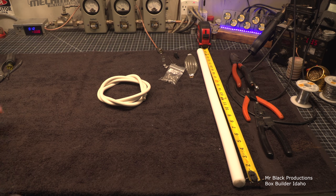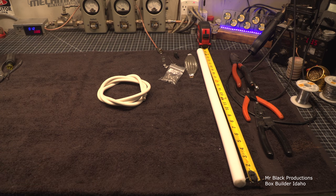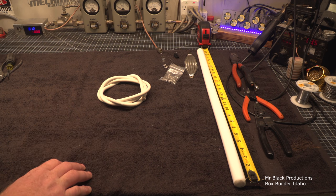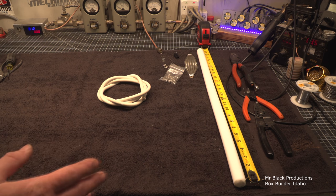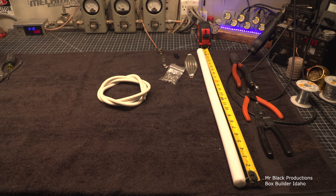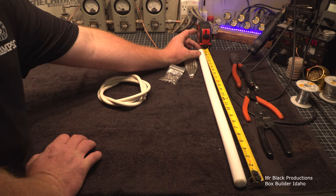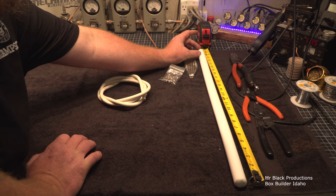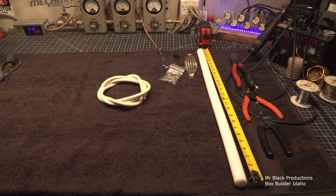In my travels, I've gone to Conco and all the different places that work with high voltage in the tubes, and usually the shorting bar that hangs out on the side of the test equipment is 2 to 3.5 feet long. Just saying. So we're going to go with that, understanding our math, that really only about this much is needed to safely protect us from the high voltage at the voltages we're working at. I mean, for this whole length of bar, we're in the 50,000 to 60,000 volt range.